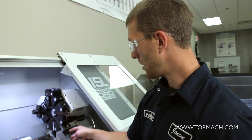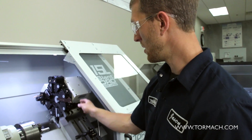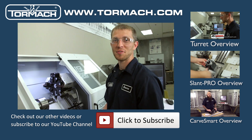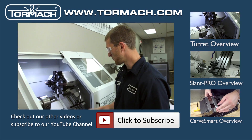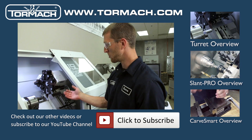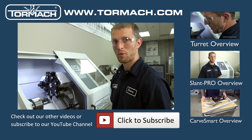Otherwise you may need to load an empty station — we may have to leave one turret station empty just to gain the clearance needed to use the gang tooling. There's no right or wrong answer to this. You just find a system that works for the parts that you need to make. This is just a couple examples of different ways you can utilize gang tooling with the turret at the same time. Feel free to mix and match and come up with a system that works for you. It's one of the cool features about the Tormach lathe — you can put multiple tool holding options together. Check out other videos on other CNC equipment. Thanks for watching.